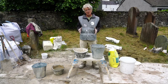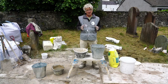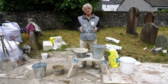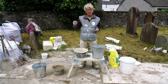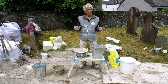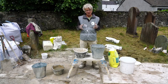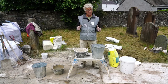So, because lime wash of any thickness made from lime putty would craze, we evolved the rule that you applied that in water-thin coats, in 5 to 7 water-thin coats typically. All of the cost in lime washing really is in the labour. I've just lime washed a whole 2-storey building in York. The lime to do that cost me £6. If I'd done that with apparently breathable, vapour permeable mineral paint or that kind of thing, for the paint, it would have cost me well over £1,000 to do that same job. So the cost in lime washing is in the labour. So if you're applying 7 coats, that's a lot of labour.